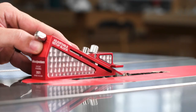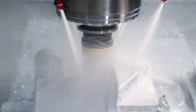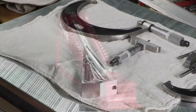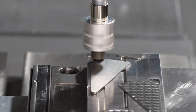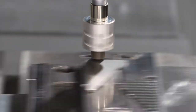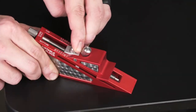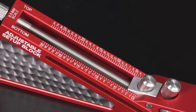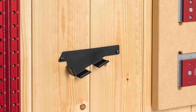The triangular base and reference surface are meticulously machined from a solid billet of aluminum and then anodized with Woodpecker's famous red finish. The stainless steel inlays are precision cut on a state-of-the-art laser cutter and then carefully polished with an old school jeweled finish using modern technology. The adjustable setup block is also available in metric, featuring a 0.5 millimeter top and bottom scale giving you a range from 0.5 millimeters up to 28 millimeters. For quick and easy storage, a wall-mountable rack is included to keep your tool well protected but always in plain sight.